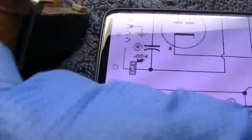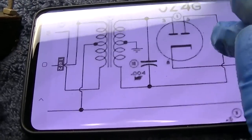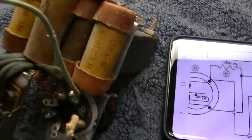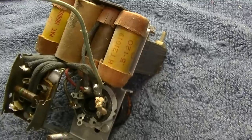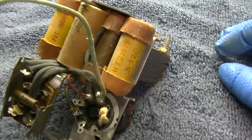So these must be the 2.5s, that's the coil, and then this one here is a 0.004. I don't even know technically if we need that or the resistor anymore going to a FET-driven solid state thing, but I'm going to just put them in there because I don't know and it's working well right now. These are RFI filters, which are probably pretty important.